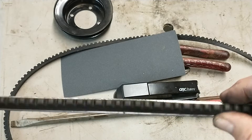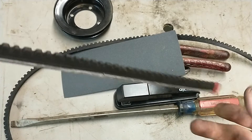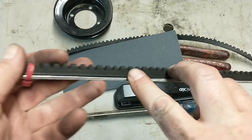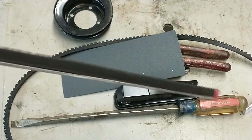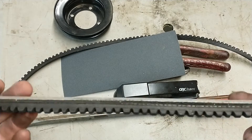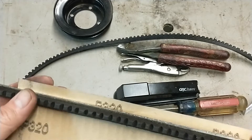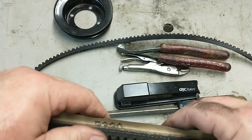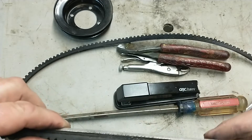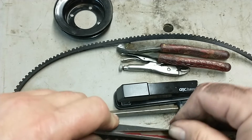This is kind of a proof of concept — it's still going to work. Think about how big the pulley is: you're only going to get maybe two inches of engagement at a time, so this just lets you reach farther in and have more stroke as you pull it back and forth. The only step left is to take a piece of sandpaper. I've got some 320 here, because you don't want to just dig away at the metal — you'll remove whatever coating it had, and also remove some of the surface the belt needs to grip on. It's a double-edged sword: you want to aggressively clean it up, but you don't want to change the shape and lose that belt contact.